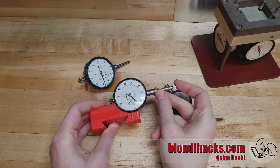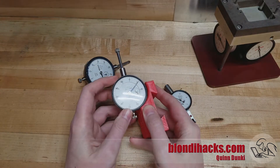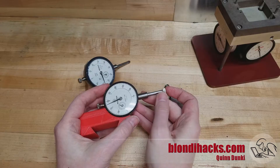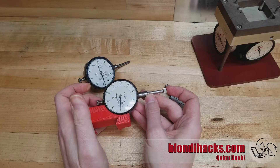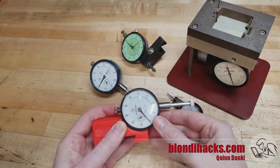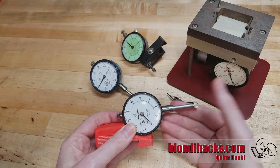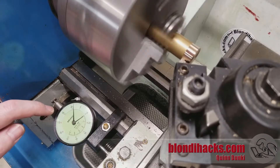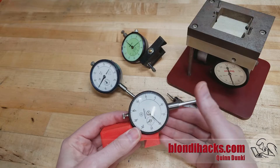Much like the handwheels on a machine tool, the indicator is giving you relative distance, but they all have this dial that you can move, allowing you to set a zero anywhere you want. Whatever you're measuring, you push the plunger up against it some arbitrary amount — which we call the preload — and from there you can set your zero, and suddenly you have an absolute measurement. You can use it to measure concentricity, squareness on a surface plate, cancel out cosine error in your compound when single-point threading, calibrate other measuring instruments, or use it as a stop when turning to a shoulder on the lathe. There are infinite uses for a dial indicator, and you really can't do precision work without them.